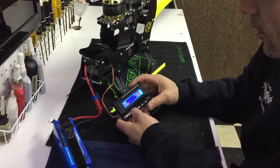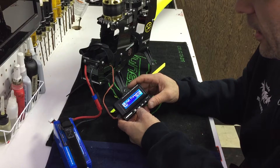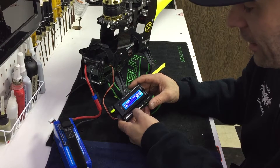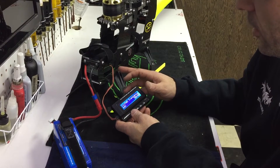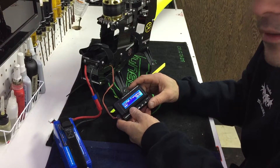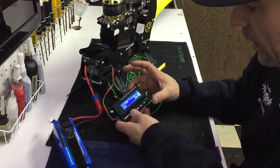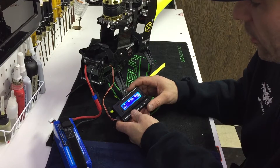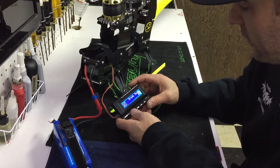Timing is going to depend on what motor you're using. PWM frequency will look a little different number-wise than most people are used to seeing — this thing is designed to run at a pretty high kilohertz. I've had good luck just leaving it at the default settings for the internal governor. It might seem like a lot at 30 kilohertz, but it seems to be working pretty well.